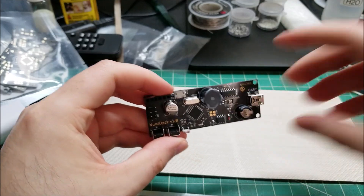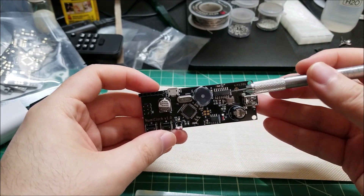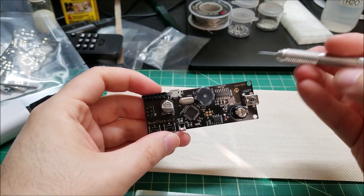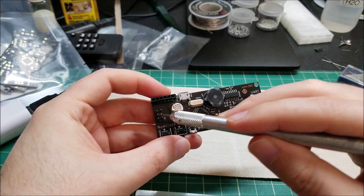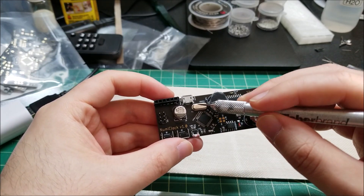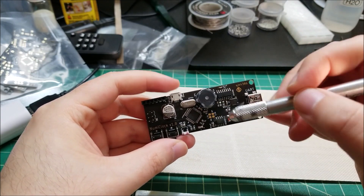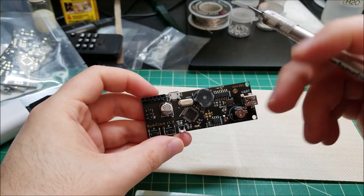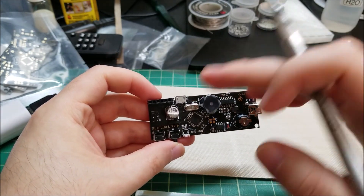The main board is here. Let's go through the features. We have an onboard micro USB, and that wires to a CH340G, which is a USB-to-serial chip with its own 12 MHz oscillator that converts USB to UART. That UART goes into the ATmega328P. Once you burn the bootloader over the six-pin ICSP header, you can program over USB — essentially this is what an Arduino Pro Mini is, so I can upload sketches as if it were just an Arduino. Additionally, I can send and receive serial messages for debugging. In this case, I'm actually using the serial connection also as configuration, so I'll show a quick screenshot of the serial terminal running on this chip.